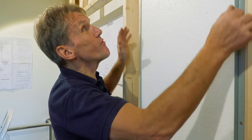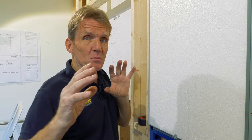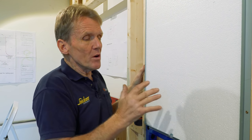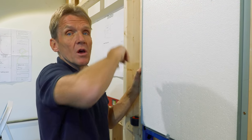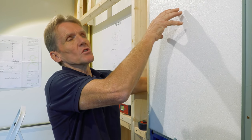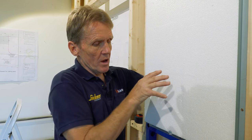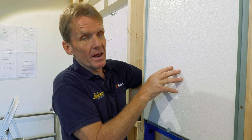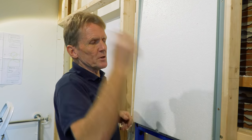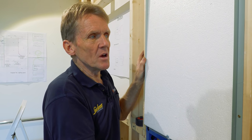When you put this easy-plan frame in it's important that it stays square, because when the cabinet goes in after tiling there needs to be a smooth docking — you've got no scope for adjustment once it's all tiled in. This piece of polystyrene isn't just packing — its function is to keep the frame absolutely square at right angles. As long as you can get it in and out easily, you've put the frame in the right place. Some people chuck the polystyrene away, put the frame in slightly out of square, and end up with a headache later on.